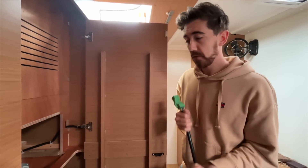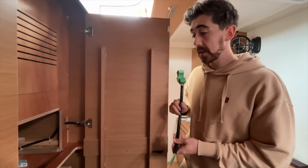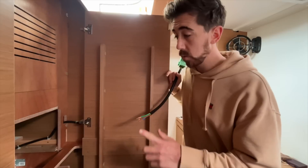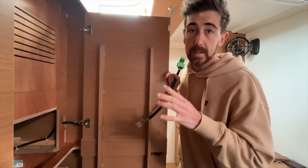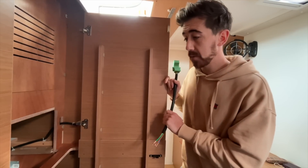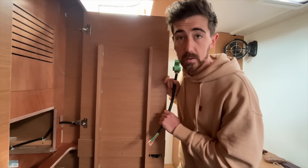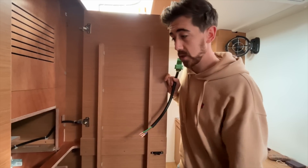Day four of fitting batteries and solar panels - we're almost there. We have AC in working and we're powering the boat. The only thing that isn't working is our AC out from the inverter. We should connect up this cable for our AC out and that should then power our whole AC on the boat, and then we're pretty much done. This is the final piece of the puzzle.